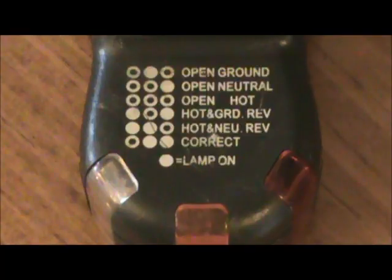That's when you're going to disconnect power. Make sure that you have no power and use your voltage detector to make sure there's no power inside that box. You're going to look for any type of wires that are disconnected or loose. If you don't visibly see anything that you can correct, you should call your licensed electrician and let him take care of that for you. Thanks again for coming to powersourcetutorials.com and checking out our video on circuit testers.